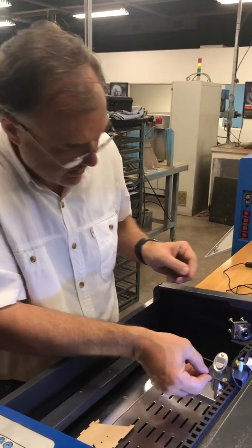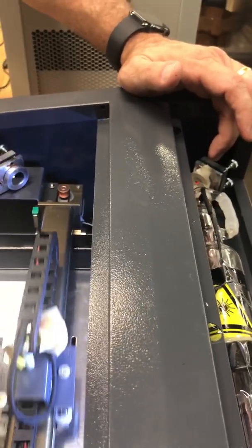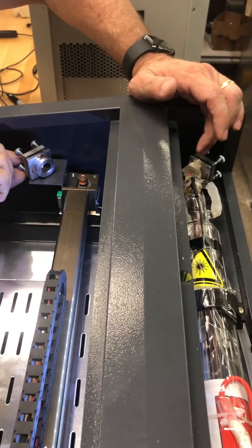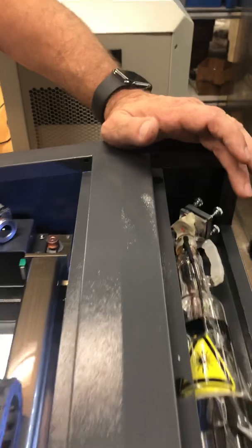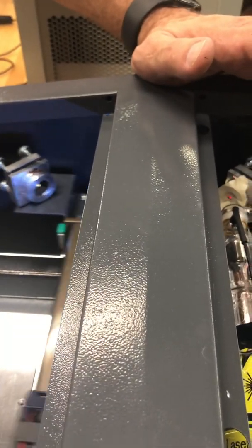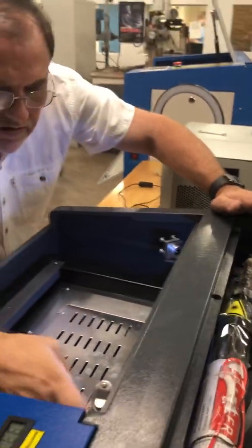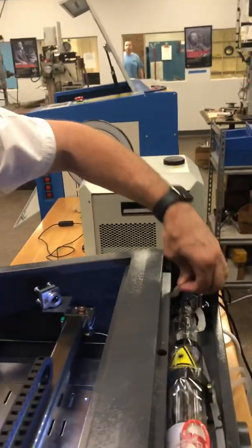I'm putting this back in, hitting mirror number one, and it's bouncing back here. I want to get it closer to where that CO2 is hitting. I'm going to move it out a little bit and see if I can make those two overlap without very much movement. It'll stay good right there and be at the same spot — so those two lasers are making contact. That looks nice. It's close and far, right in the same spot. It's actually looking really, really good. My mirrors are aligned. Mirrors three and two are good.